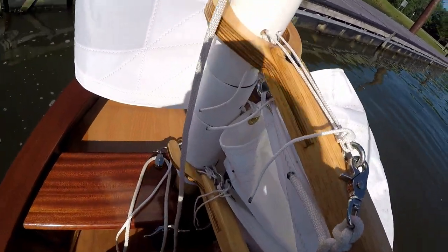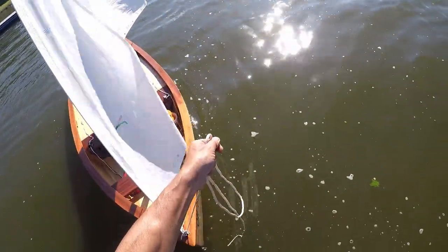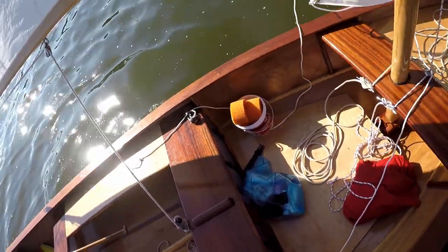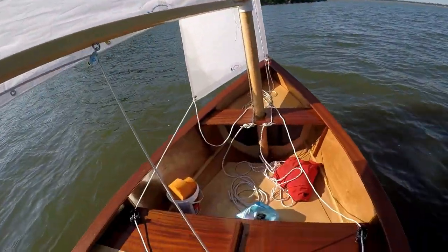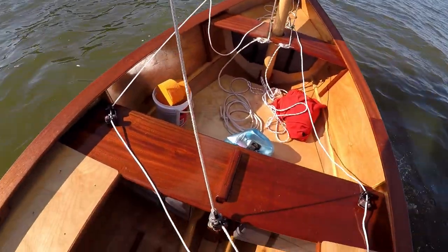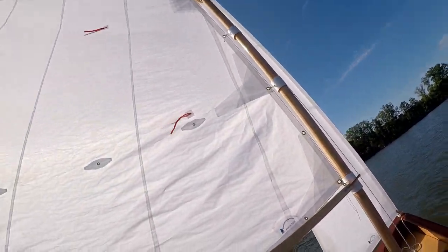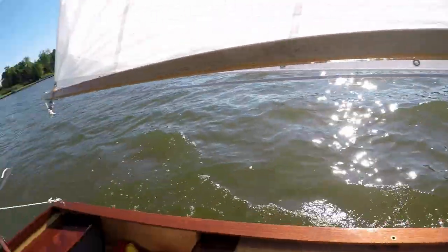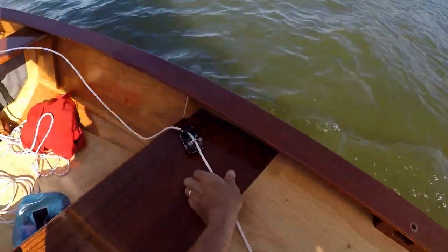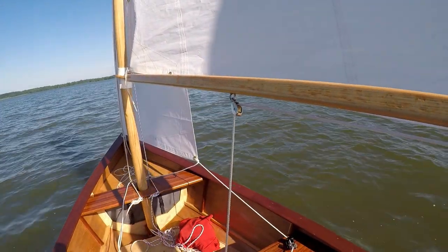You've got to remember too, unlike with my bigger boat Cosmo, where if you're going to pop the sheet the jib goes first — this tiny jib, you need to pop the main first. And then on a tack, I think it can help bring the bow around, which has been difficult with all that center of effort aft.